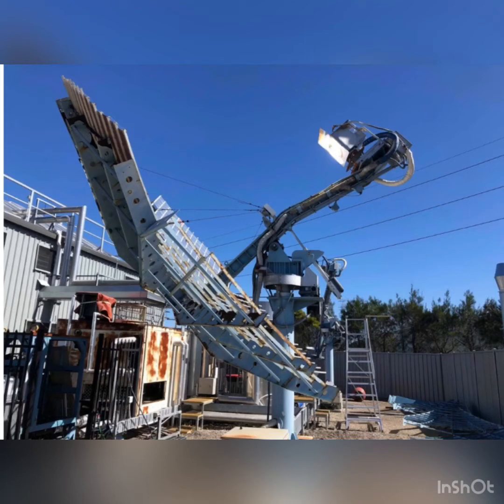It was built as a replacement for the old receiver and decreased the energy loss to ambient air by firstly installing an insulated flap over the front window. Increased insulation thickness around the whole side of the block was also used within the receiver. On top of this, a larger window was used to capture more of the concentrated image of the sun, and the storage volume was increased by 100% over the previous receiver to demonstrate the scaling up of the technology.